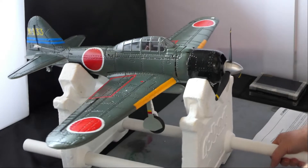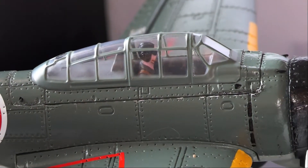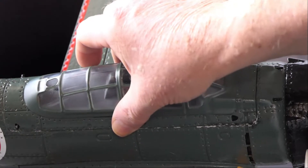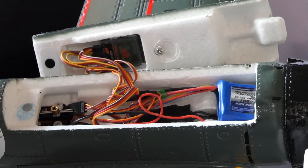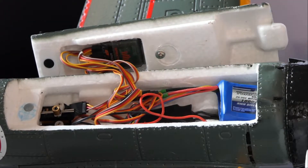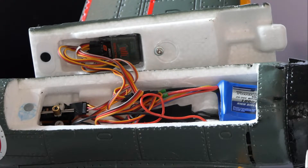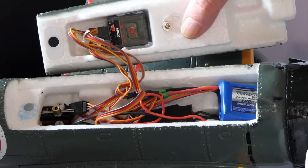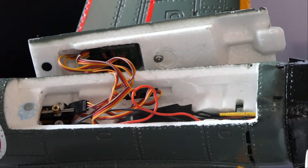The solution I've come up with isn't pretty. Let me show you inside the canopy first - I haven't done any binding or anything yet, that will follow. So this is my solution: inside there we have a 1000 milliamp-hour battery, a 3S speed controller tucked away down there, and the receiver up here. Yes, it's quite far behind the center of gravity, but it was the most convenient place to put it, having cut a ridge of foam out from the center of that cutout.